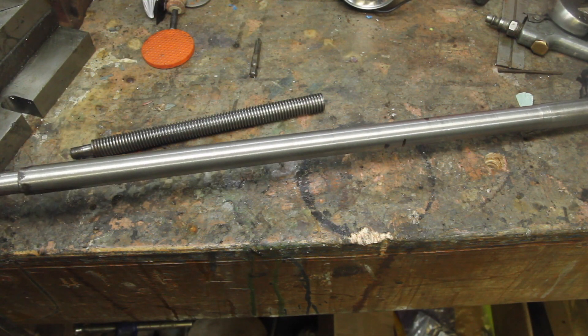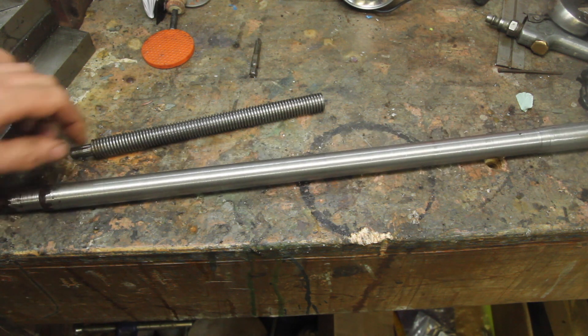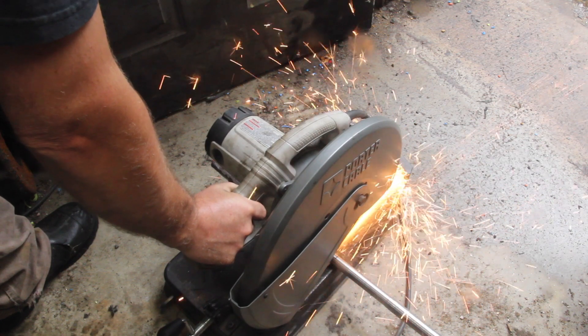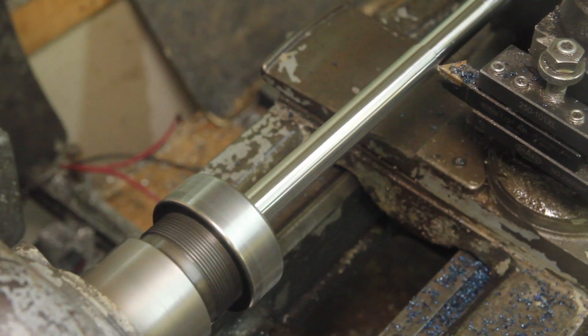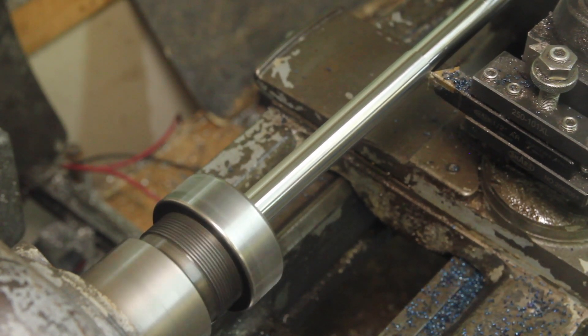The rust cleaned up on that, but the cut is just super chattery and terrible. I still have a good ways to go, so I'm going to shorten this up and see if that helps clean it up a little bit. This carbide tool is cutting a lot better. Looks nice.